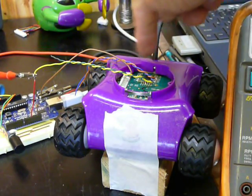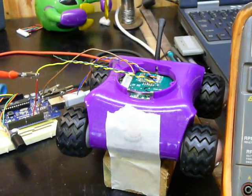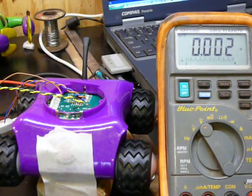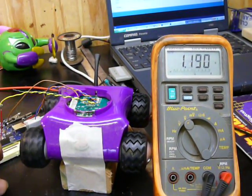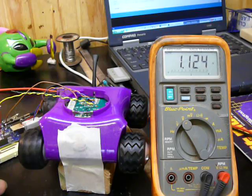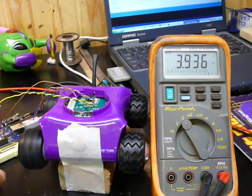Because we have a driver board in and I hacked into where the inputs are, I can hook an Arduino board up to it, and the Arduino can control the output. There's the voltage right now. As I raise up the voltage going out from the Arduino, it's pulse width modulated — same voltage, but it's just turning on and off real fast. It's changing the rate. Right now it's turning it on and off at a slow rate, and now at a higher rate, which makes it go faster.